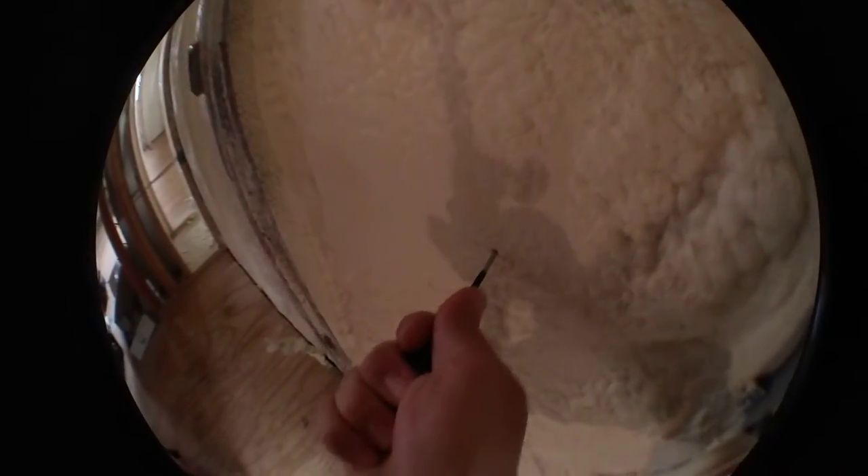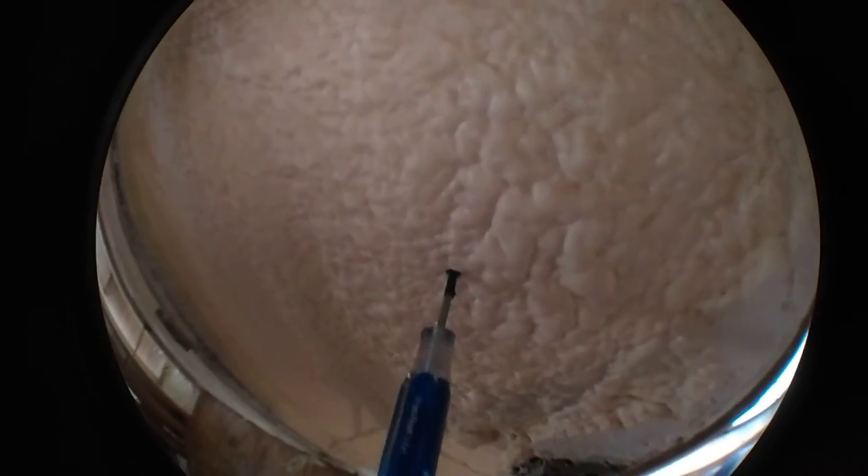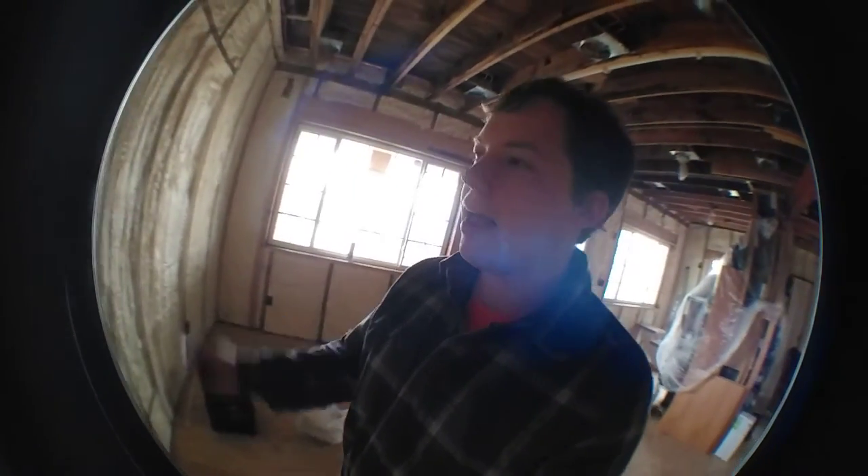It is two and a half inches average, so right here I actually don't have enough — I'm about a half inch short. But if I go up here, I've got a little extra. This spot I would have marked out had I seen it during the project. Upstairs initially I had to mark out a bunch of spots, and when I asked the installer when he'd go back to depth check, he said it was probably good. I told him I had spots as low as one inch when it's supposed to be two and a half. He apologized and they fixed it. One spray foam contractor told me insufficient depth can actually cause condensation inside the wall — so it's not just being picky, it's functional. Make sure you get what you pay for.